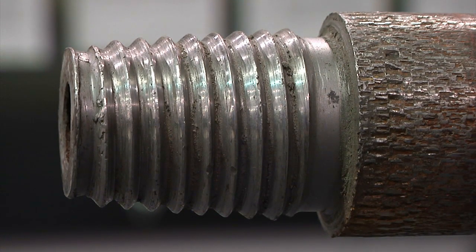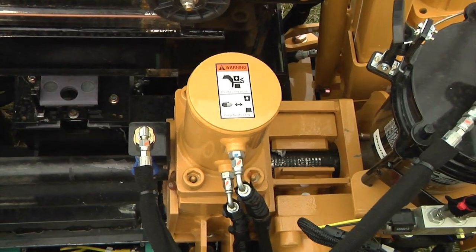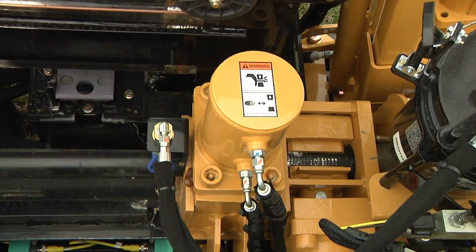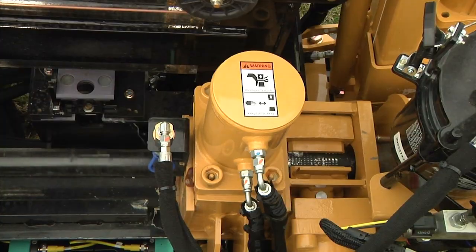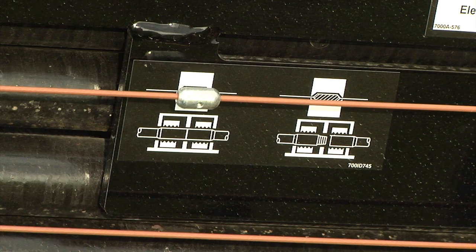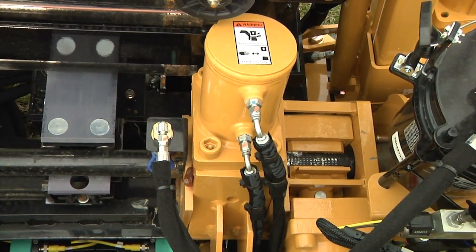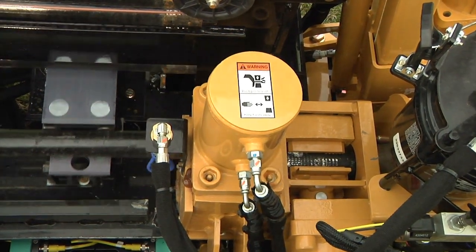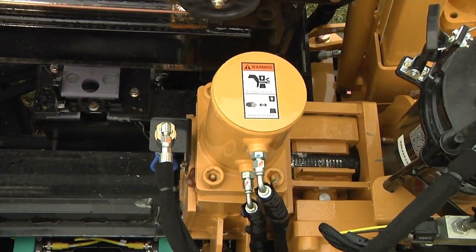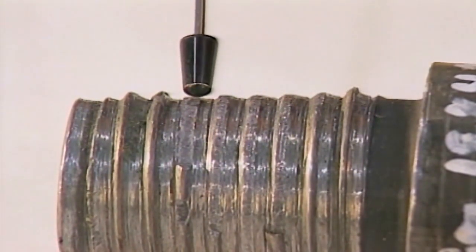You should be at least one half inch away from the box end and shoulders. To break the rod connection using the power vise: clamp the lower and upper vises, rotate the upper vise to break the joint, unclamp the upper vise, then using reverse rotation, unthread the joint. While continuing rotation, use reverse thrust to move the rod back until it is aligned with the second mark on the joint indicator. Clamp the upper vise, rotate the drive chuck to break out the upper joint. Once disengaged, continue rotating and use reverse thrust. Too much reverse thrust will cause the thread to rip out, possibly stripping the threads. These stripped threads come from forced breakout — most thread problems come from forced thread makeup and breakout.